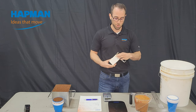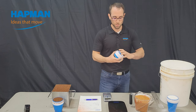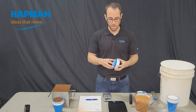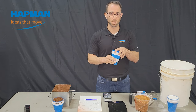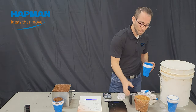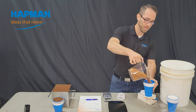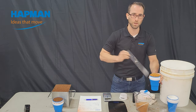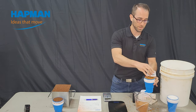The main topic here is to show you how to use this cup. It comes in this box, and you want to remove several pieces before doing the measurement: you don't need the lid, there's a straw inside you don't need, and there's a little holder that you'd use when drinking from it as a travel mug — but for measuring bulk density, we don't want it. Simply fill the cup all the way until it's overflowing — make as big a mess as you need, because it's really important to make sure it's level at the top. Use whatever you've got, like a ruler — this piece works well to get a level top.